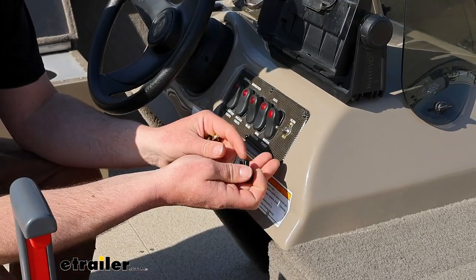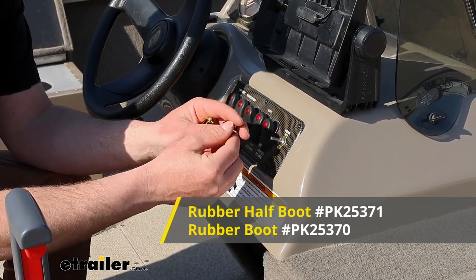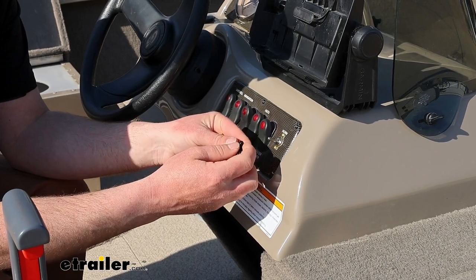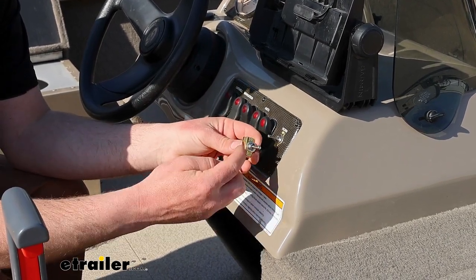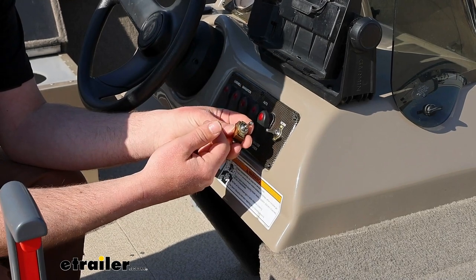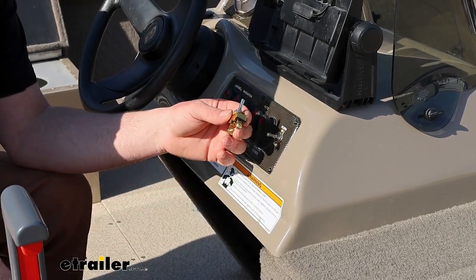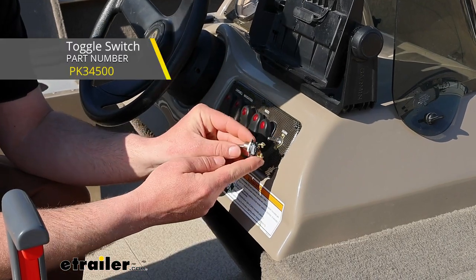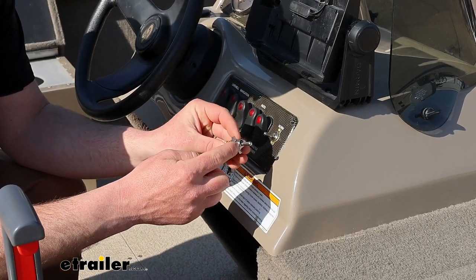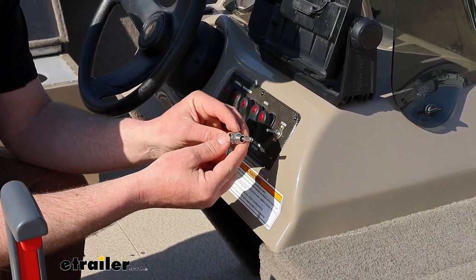We do get a lot of people wondering if these little rubber boots will work with this switch. These will go over it — full coverage or this one kind of just covers up the base of it. But unfortunately, these boots will not work with this switch. The threaded portion of the switch is just too small, so you won't actually be able to thread the boots onto it. If you're dead set on using one of the boots, or you're not too crazy about the body of the switch being brass, there is another alternative — this one, also made by Pollock. Very similar in what it can handle, and the threads are the correct size that will allow you to use those rubber boots.